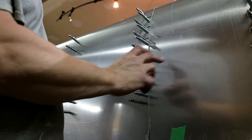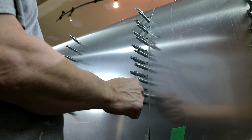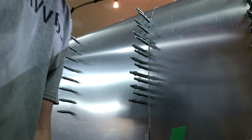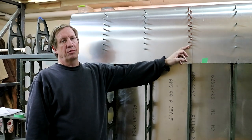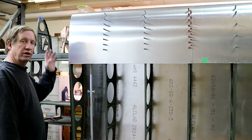So this is a double row. Since these are two 25-thousandths sheets, these holes will actually get opened up to number fours. Now the sheet's installed after I trimmed the sides and opened up the double row of rivets on the lap to number fours. I'm going to move on to the next sheet.